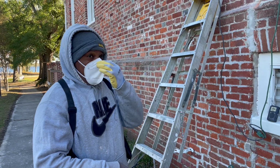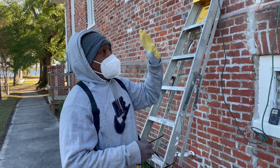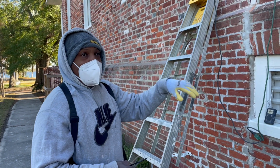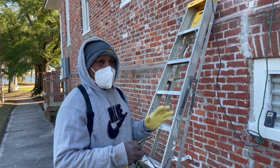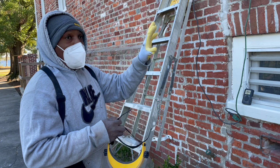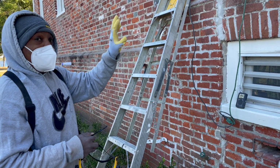Now this time of year, the wintertime, the burlap keeps the wall warm. So after you lime point, you want to put the burlap on and then a tarp. You're keeping the wind off of it, and you're keeping the rain off. Today it's 30-something, but the wind chill makes it feel colder, probably below freezing. So it's very important on a day like today to have the tarp and that burlap, and tonight it's going to get in the 30s. Tomorrow night it's going to get in the mid 30s, close to freezing.